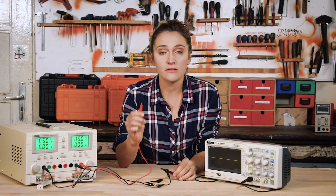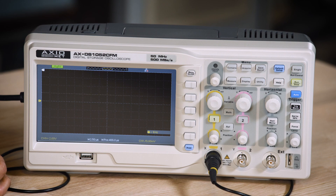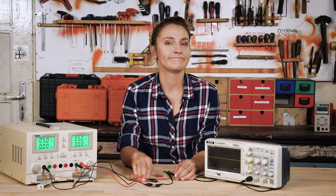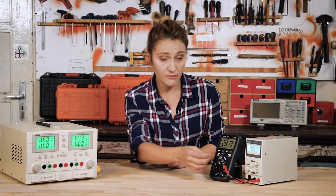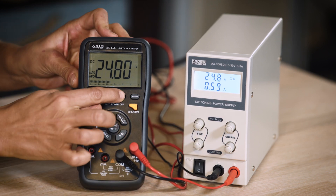And as you can see, the right channel gives you the positive voltage and the left channel gives you the negative voltage. Now you know. Each of the variable channels has two displays: one for voltage and one for current. In some power supplies, the readout is not as accurate as you may think, and other power supplies have coarse and fine adjustment knobs — but I suggest you verify it with a digital multimeter.